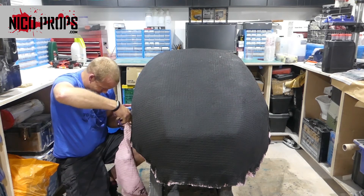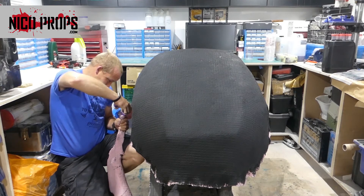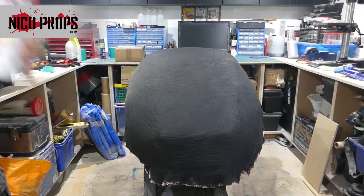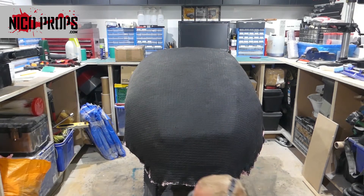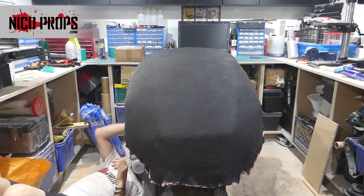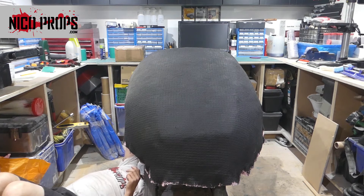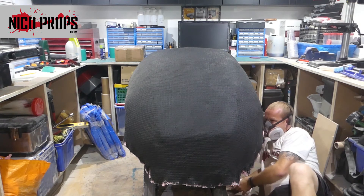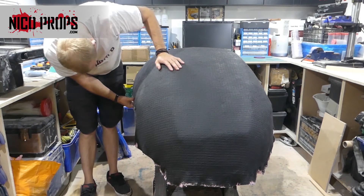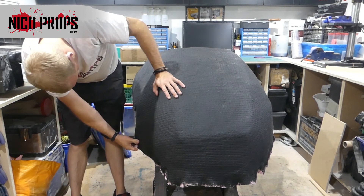The material is hanging down probably two or three inches below the level of the dome plug, so I've got a fair amount of space underneath. I'm going to use this orange plastic coat — it just happened to be a spray I had kicking around — and lay it down on the floor and spray around the underside edge that's hanging over. When that's dried I'll know exactly what piece I need to cut off so that the dome fits the body mold. All I'm doing here is going around the edge pulling it out to get a bit of air underneath, and eventually I'll stick some wedges in there and give it a good pull.